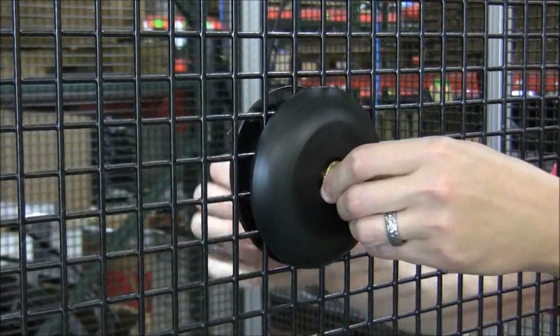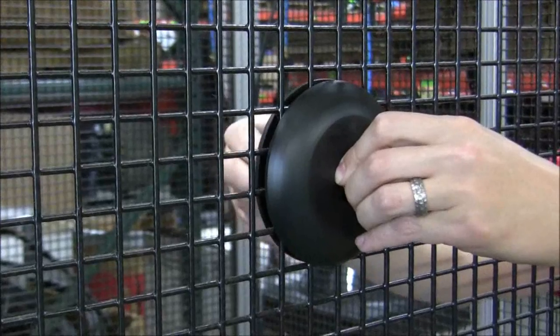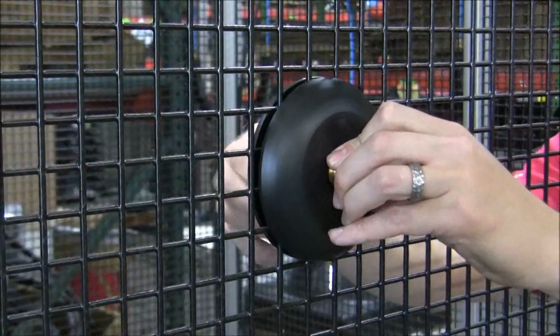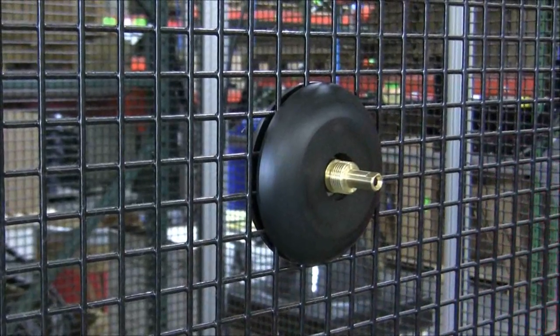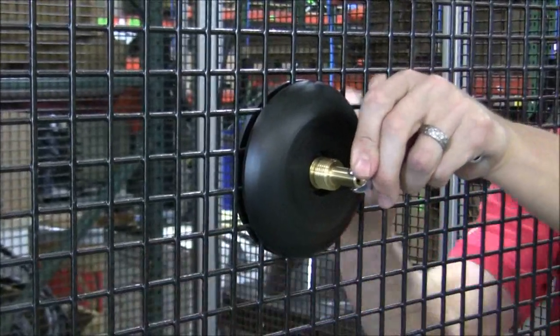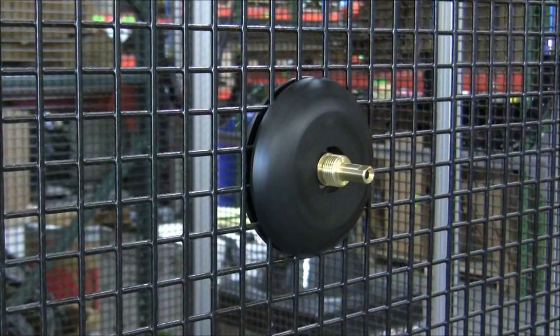Installation is simple. Insert the male threaded portion of the union probe through a small silver washer and the large union flange. Place the insulator bushing over the threaded portion of the union probe on the side of the union flange that is placed against the cell wall. Repeat the same steps for the other side of the cell wall mount kit. Thread the union probes together and tighten.